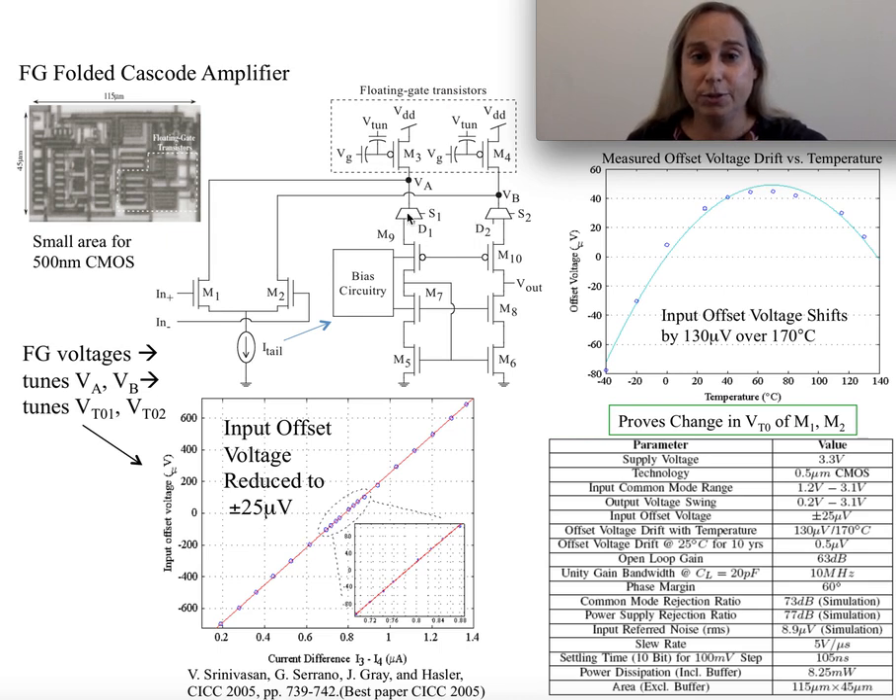You might wonder why there are MUX elements here. These MUX elements are very explicit to show what elements you might need to deal with for programming. In this case, you have a switch between the actual signal path or having the drain voltage available for programming. This particular topology is consistent with a typical direct programming type of configurability. By tweaking currents, you might be able to get one particular bias point over temperature and maybe achieve some improvement.